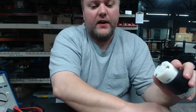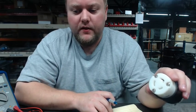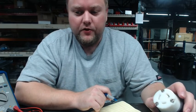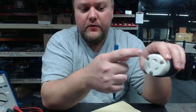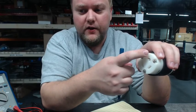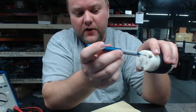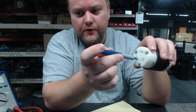The best way to do that is to check all possible combinations of pins. Let's take some notes so we don't have to remember things. On this receptacle, we'll pick and call each of these terminals something. We'll start with the top one and call it terminal 1, terminal 2, and terminal 3.